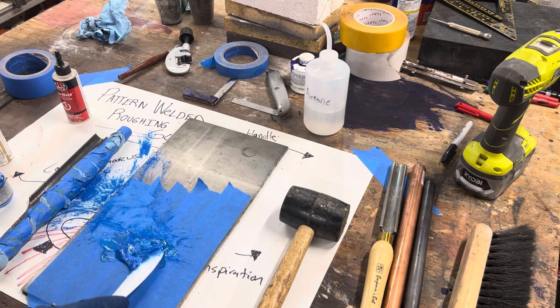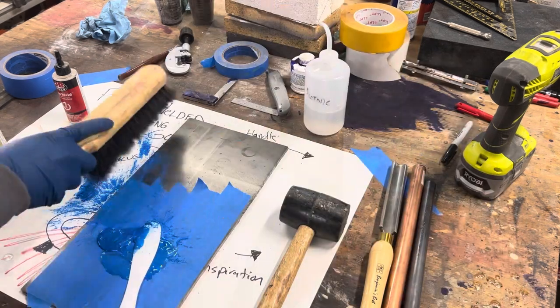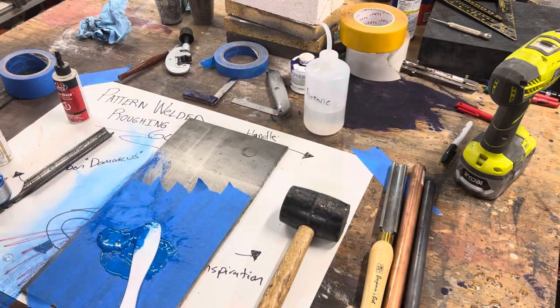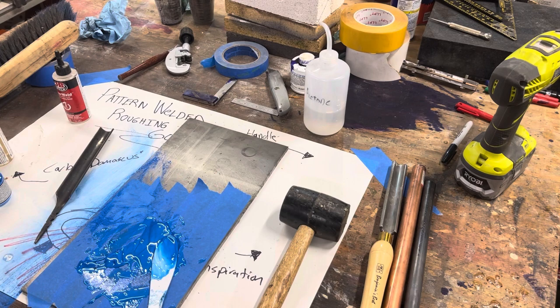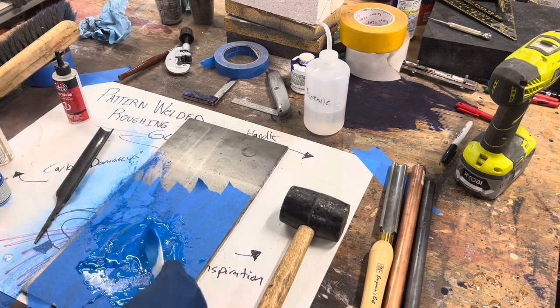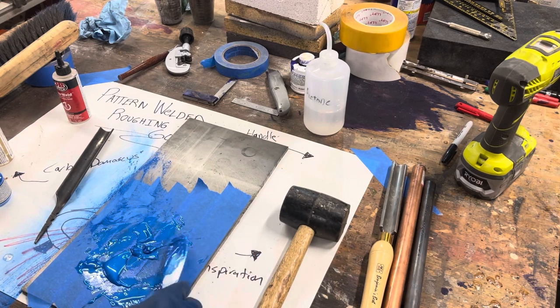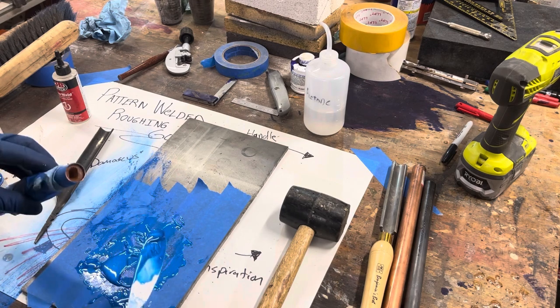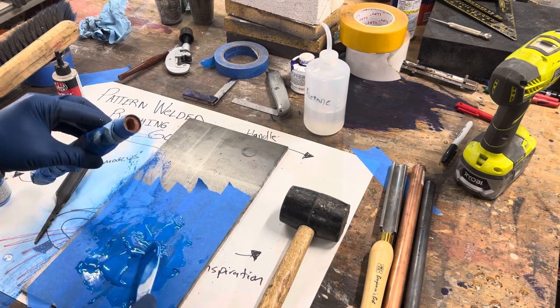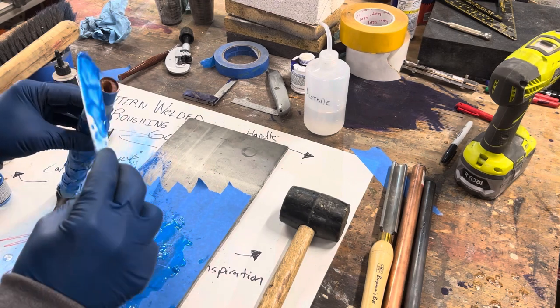A little tough to tell what's going on on this blue tape, but I can check it against the white paper and see how that's mixing. Okay, minus the minor incident, spilling my pigment powder all over the place, I think the epoxy is mixed and looking good. Should be ready to go, so I'm gonna start by putting some down in the handle, and then I will probably roll the blade around in it as well and make sure this all gets nice and filled up.